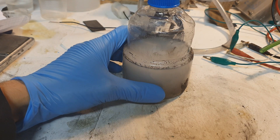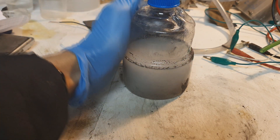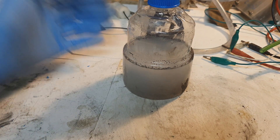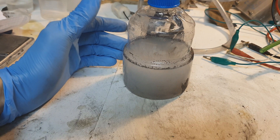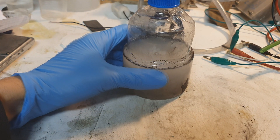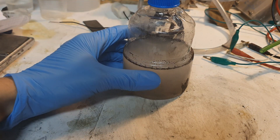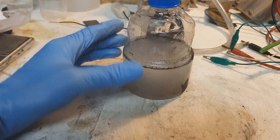When you put aluminum into the sodium hydroxide electrolyte, the reaction is exothermic, so the solution heats itself — and the hotter the solution, the faster the reaction. The concentration of the electrolyte also plays an important role: the higher the concentration, the faster the reaction will be.